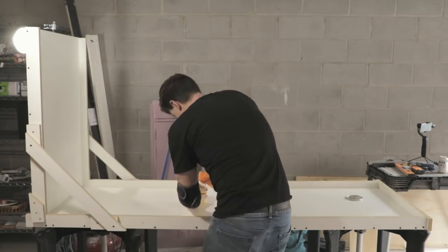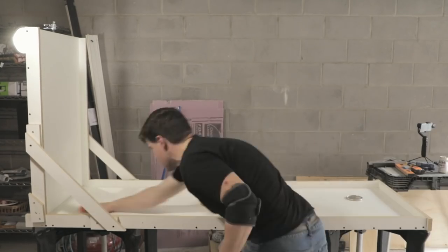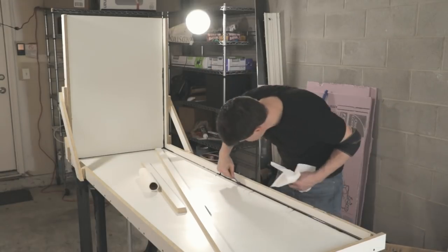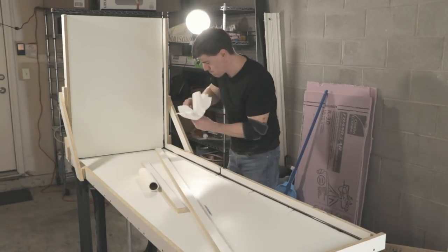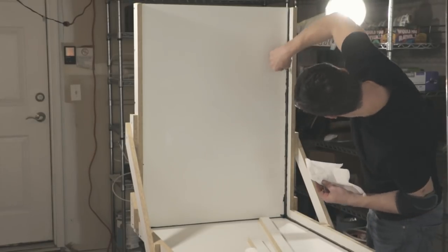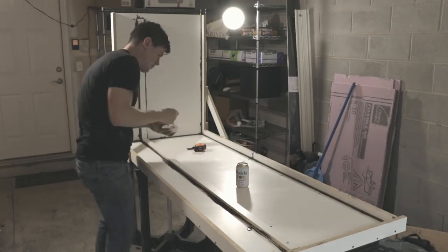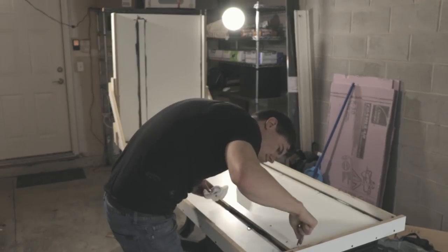Here I'm using the same technique I've used in past videos with concrete forms: a paste wax followed by silicone caulk, then running around all the edges of the caulk with a metal ball tool. Go back and watch some of those older videos to get this technique — it's a really great way to get a clean and perfect caulk line in your concrete forms.